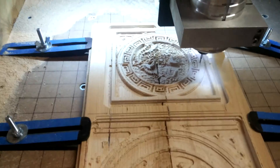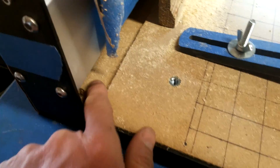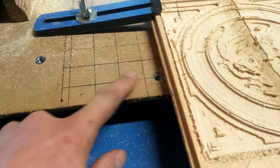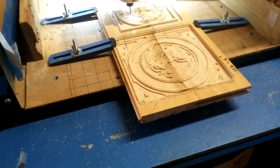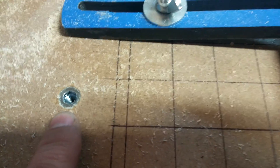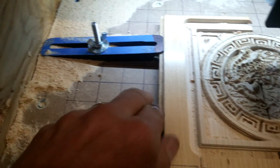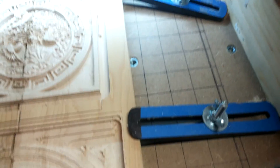The other thing is I don't understand how people are spending $400 for the Shapeoko's new CNC table. All I did is raise this up another quarter inch so I can put my material above and come out like you see. You can go buy these little quarter-20s — 40 cents each. Pop them in where you need to. This is really strong hard plastic, so just thread them in.